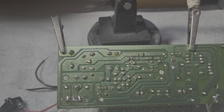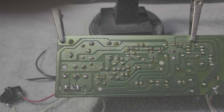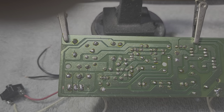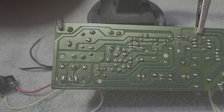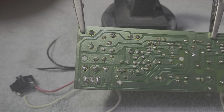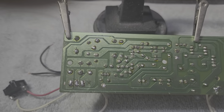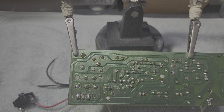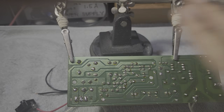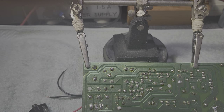So this is one way on how to troubleshoot for those who are new in troubleshooting. If the circuit board you're troubleshooting is actually not responsive, and you can see that the parts by inspection or by measuring their values, you could not see anything, try to reheat the back connection like what I did, okay? Try to use your soldering gun and make it a point that there is no splashing to the other terminals to avoid the short circuit.